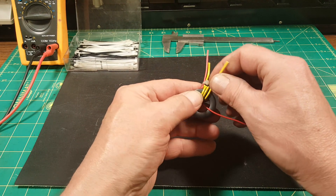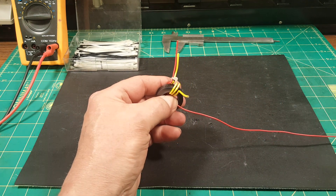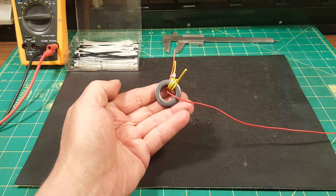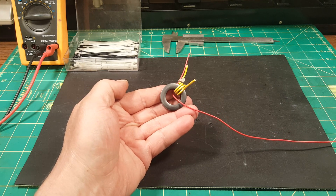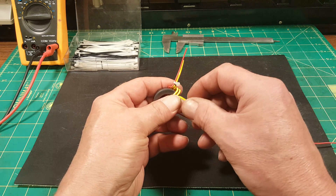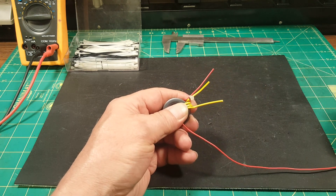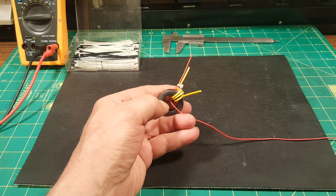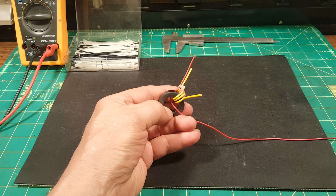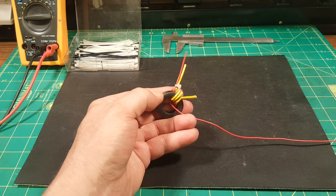What I want to do is wind a nice little true QRP core — it'll handle all of 5 watts, and it'll also handle 25 watts CW, getting a little warm key down. We'll look at that with this auto-transformer when I'm done. I've measured my spools of hookup wire — they measure the exact same as the brown wire I used in the last video. I need smaller wire than that if I'm going to get all 8 taps on that core, so I'm going to rewind it.